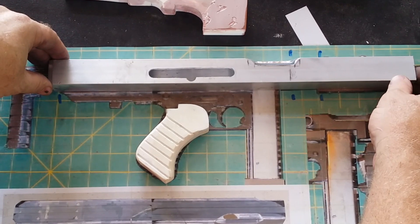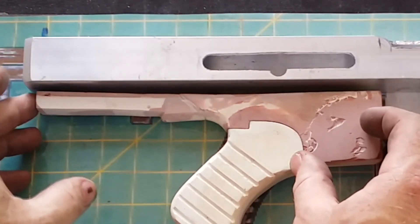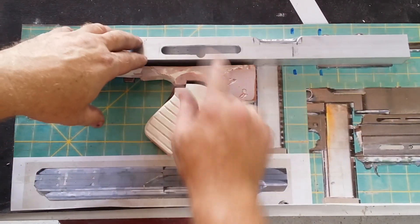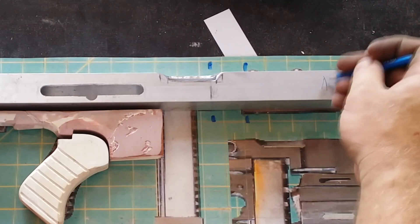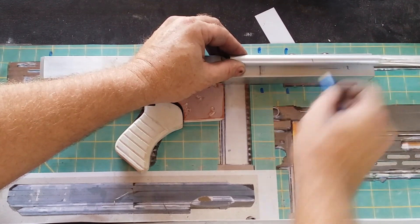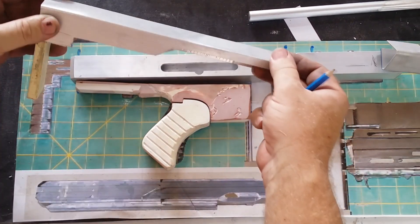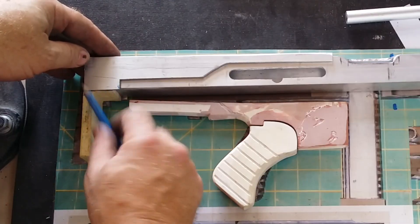It does show me a couple of things. The piece I've prepared for the top section is pretty dead on as far as size is concerned, but the resin piece that fills that gap is still quite a bit out of whack and needs that space bridged so it's a neat fit. That piece will be cast as a single solid piece and then cleaned up and milled out where I need it for the trigger and all that. I've already milled the slots in there, there's a step section that has to drop off the height of the metal, and that forward piece is a bit long and probably needs to be trimmed. I've found a barrel piece which itself is a bit long — it'll be trimmed to match so that I've got a mounting point, and the cut length will be determined by where the forward heat shield is mounted. Still haven't milled any slots into the rear stock yet, but it looks like I need a bit more practice on that. You can see how it will fit there and pretty much where it will butt up once that's done in aluminium.